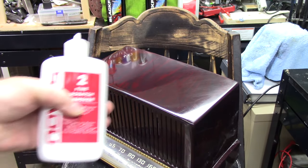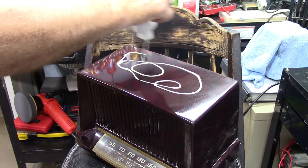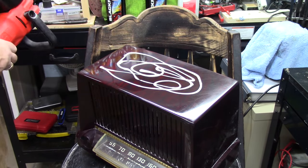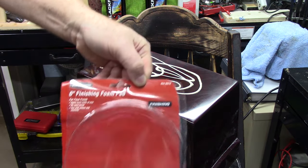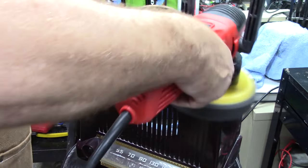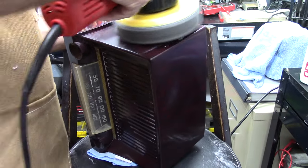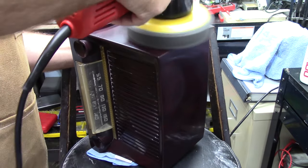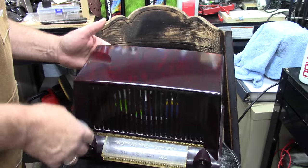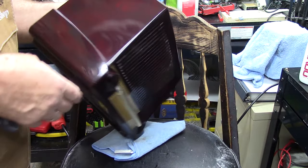I had remembered that I purchased some Novus No. 2 specifically for polishing plastic radios like this. So here I am squirting some on there and getting the power polisher back on it. I'm using my fine foam disc on this — a 6-inch finishing disc. Going on a higher speed, polishing the side and the top — I obviously dubbed this tape and made it shorter than it actually was. That Novus No. 2 did a really nice job. Very happy with that.